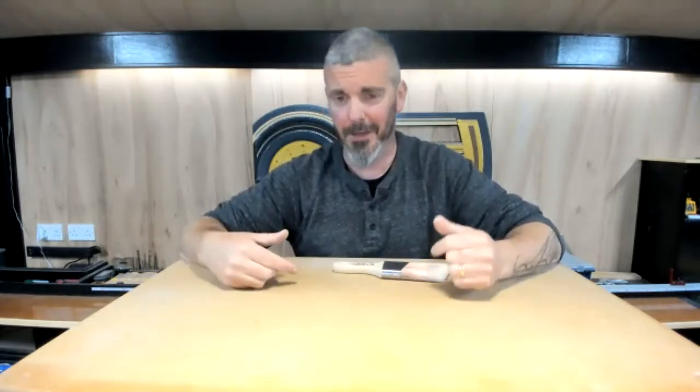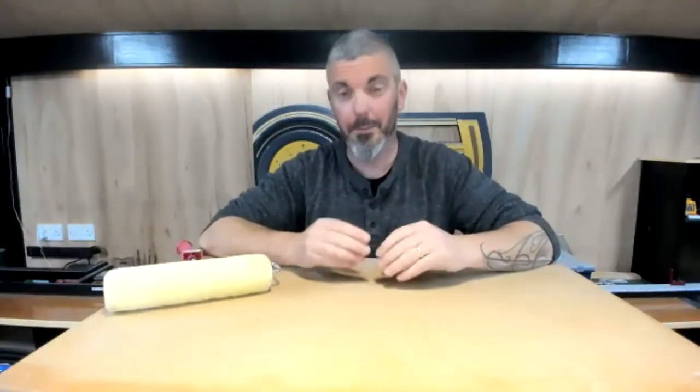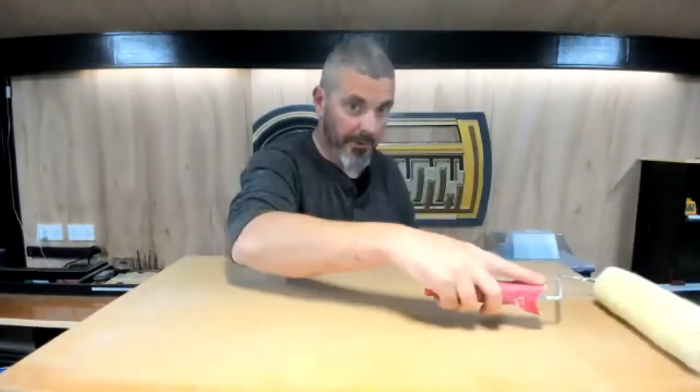Yes. That's always how I've approached the wall. You get down from upstairs first. So basically do the ladder work first, get out of the way, then hurt your knees for a while, and then basically you do the middle bit, the easy bit, at the end. And what I've always said when it comes to painting as well, so you put your paint on, and it's very important after your paint has been on a while that I always give it another rub, always, but very lightly. So if I was painting this as a wall, and this is the top and this is the bottom, first thing I'm going to do is get my brush, get up on my ladder, do it 2 inches all the way around, work out all my edges first. Then I get my roller and I get up on the ladder and I do the top third. I do the bottom third down on my knees, and then I do the middle.